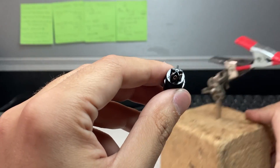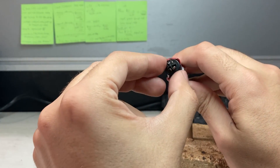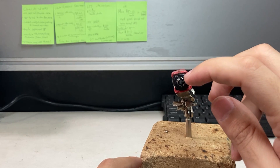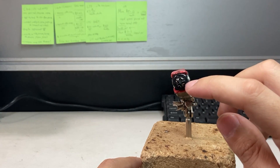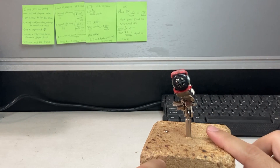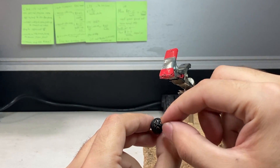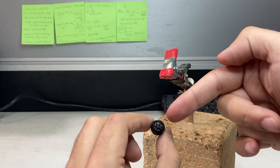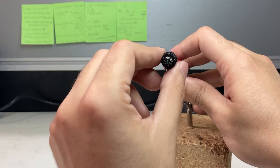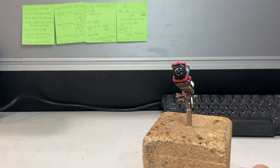So you need something to actually hold onto it. I have a block here — it clamps on and allows me to just put it here. And I could start putting some solder on these ends so it could actually help stick on to the cable. If you don't have a block, you need something else to hold it up. Because if you have one hand here and try to do it, it's possible, but how are you going to also feed in the solder? You need something to hold your actual five pin. Even if it's leaning against the table, you can do it.